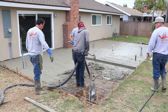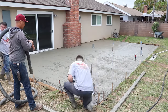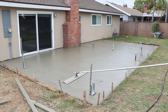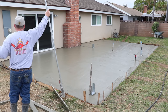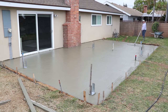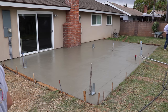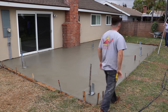It's just me, my brother, and my son pouring this one out. You can see those brackets — I set them about three-quarters to half an inch above top of concrete so there's no water sitting underneath the posts, which means your wood lasts a lot longer — no standing water, no dry rot. It's actually going to be a barbecue island, which is why you see all the electrical stub-ups over there. It's an L-shaped barbecue that fits into the corner and actually encases two of the posts.